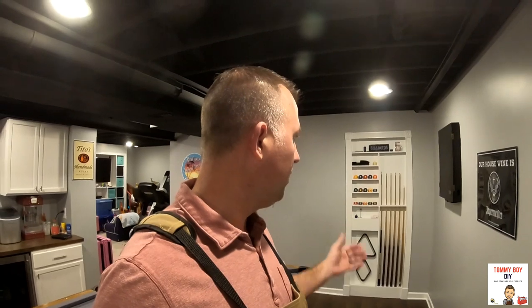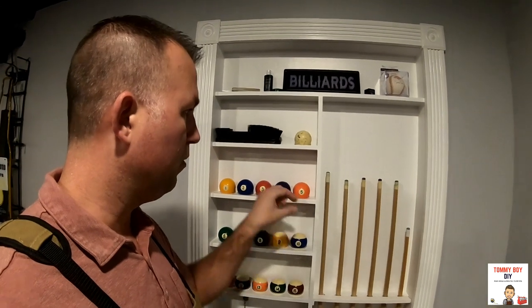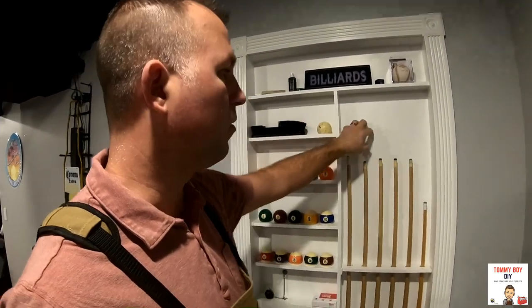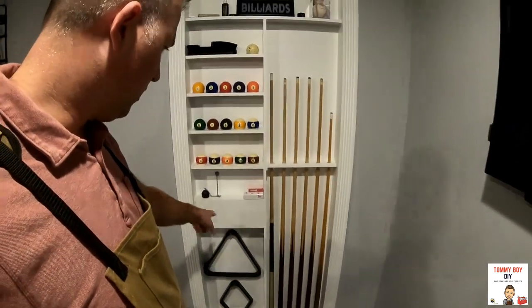A bookshelf is obviously deeper, so I figured something like this would be perfect. I had just enough depth that if I put a door that opened in, it would actually be about three inches on this part to make the rack. So I ended up taking a hollow-core door — a regular normal house door — and I did quarter-inch board onto it, nailed and glued, and then I built the pool cue rack on that. This rack is just built out of half-inch MDF, and I used a Kreg jig on the quarter-inch. I drilled holes for the pool cues to fit at the top and bottom.